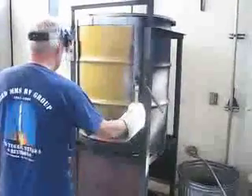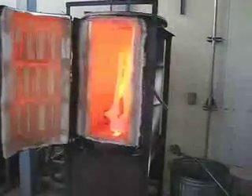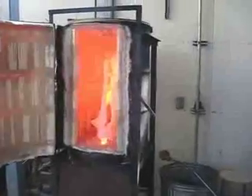Kristen's piece has been in the burnout furnace for about a half an hour and all the wax was taken out. We open the door and just look for any particular cracks. This looks pretty clean — we don't see any cracks. You'll notice that it is quite hot, red hot. So this looks like a successful burnout.